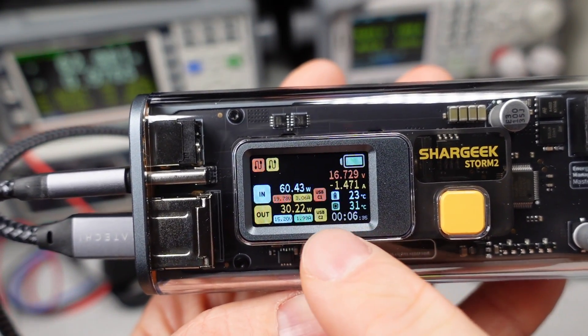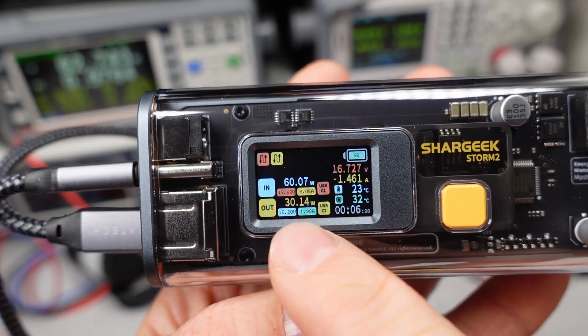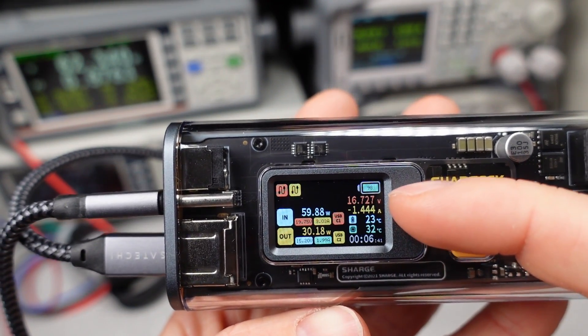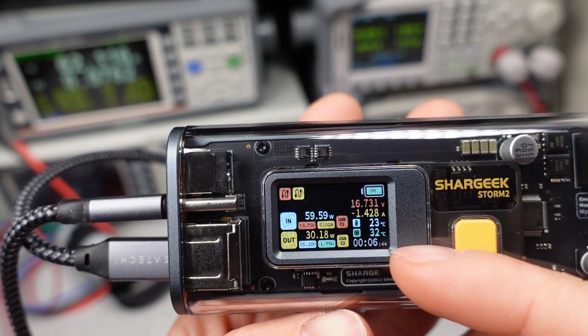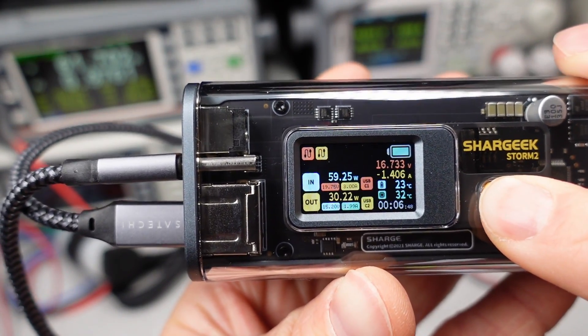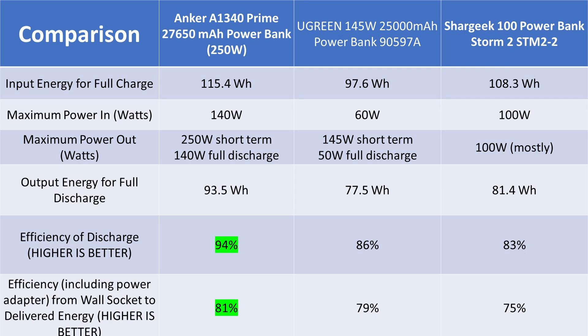The battery percentage appears quite good, but the voltages and currents are certainly for indication only — they bounce around and change throughout the operation range, so again, for indication only. This power bank is also pretty lossy: 25% power lost from the wall at 50 watts and 28% lost at 100 watts. This isn't winning any efficiency awards.